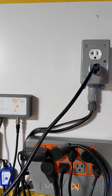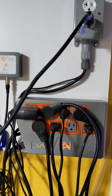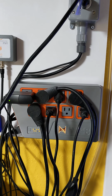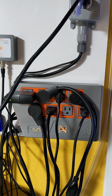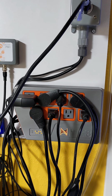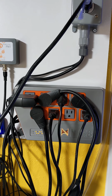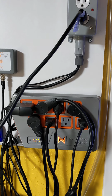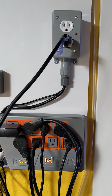So the subsequent ones, I'm going to move my lights to either side of the EB832s. Each EB832 is run to a completely different 20 amp circuit onto itself. So I have everything spread across the 2. That way, if one circuit ever goes down, I don't lose all my pumps, I don't lose all my heaters, or all my lights. So it's pretty bulletproof in that aspect.